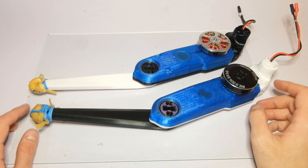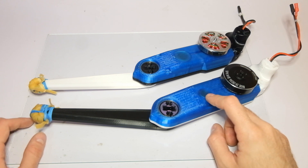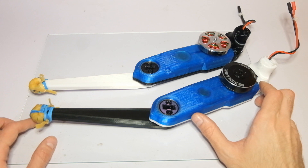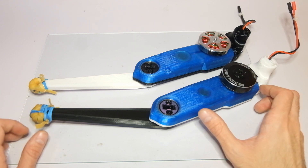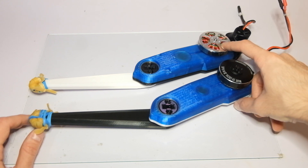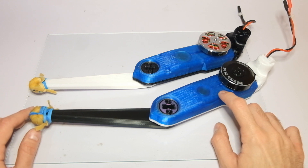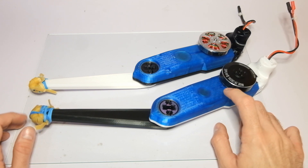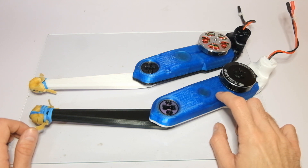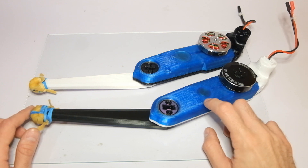What we're going to do now is do a torque test for this new prototype with the new motor and compare the results to see if this would be more appropriate for the knee actuator. I'm still going to use the 5010 for the other eight actuators, and the new QM5006 probably for the knee actuator. I'm going to evaluate if a 1-to-9 reduction for the knee with this new motor is going to be enough.